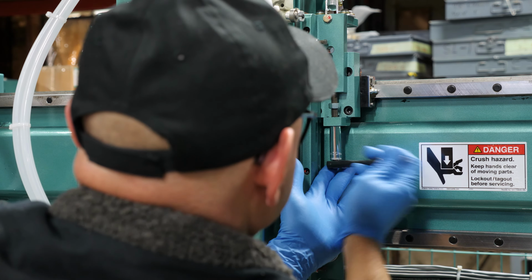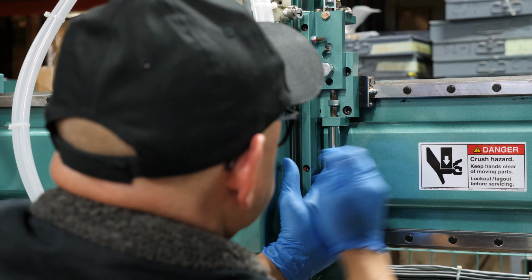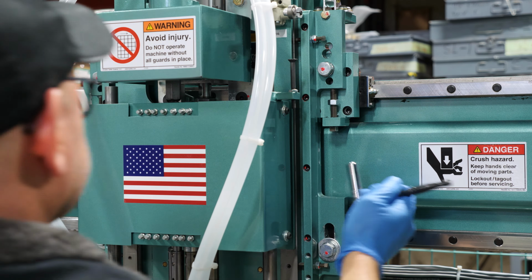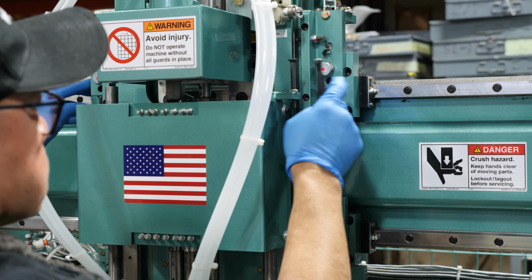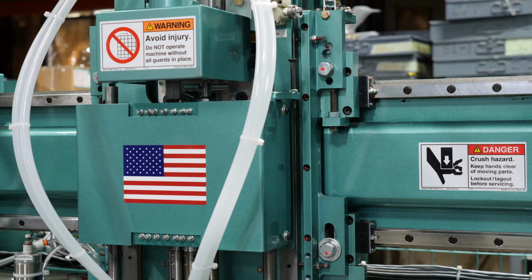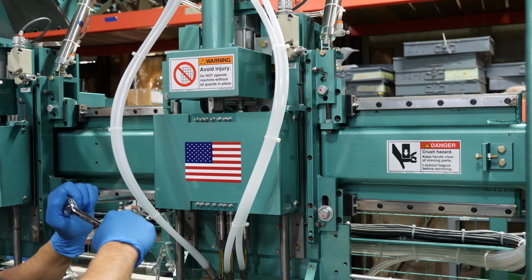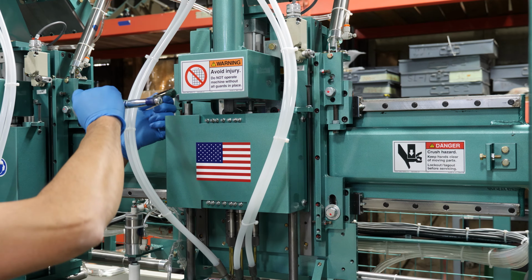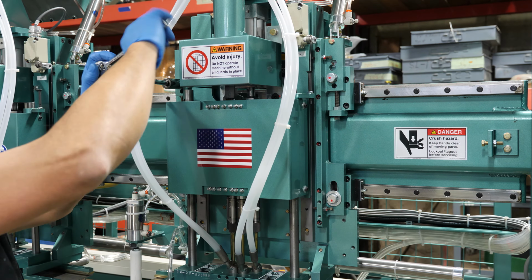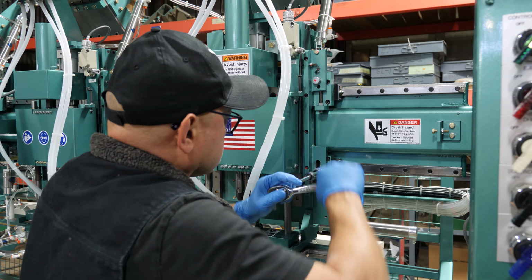That gives you enough room clearance for that motor to come underneath head number 4. But if you're running every other width of door, you're fine. You don't need to do this. It's just for your 8 3/4 door. Then you just tighten your bolts back up. On the back side, when you lower it back down, there are dead stop bolts that'll stop it when it comes down so you're in the same spot every time.